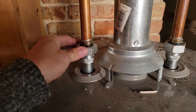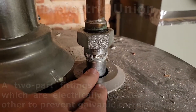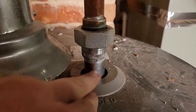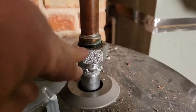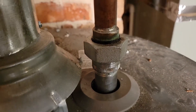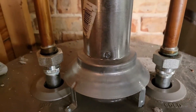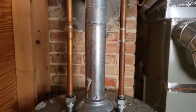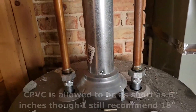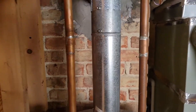We should have dielectric unions if the water heater is connected to copper, because galvanized piping connecting directly to copper can cause corrosion and deterioration of both the copper and the stubs on the water heater. I've seen water heaters without these dielectric unions where the top rusted out in less than a year and a half. Put them on both sides. Also, make sure you do not have any plastic or poly connections within 18 inches of the connection — within 18 inches it needs to be rigid piping.